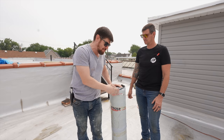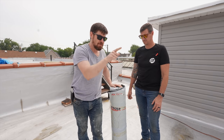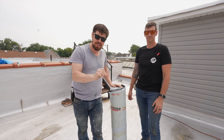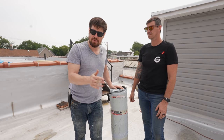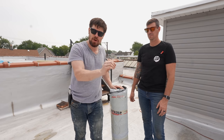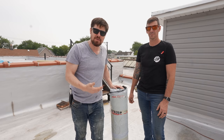First up, we got this rubber base sheet. It's a roofing material, waterproof, got a self-adhesive. We're gonna stick it to the underside of the sleepers to get some separation between the sleepers and the roof. The reason we're doing this is that you want to avoid water pooling up next to the wood, right between the wood and the existing roof, which could lead to rot, even when we're using pressure treated wood.